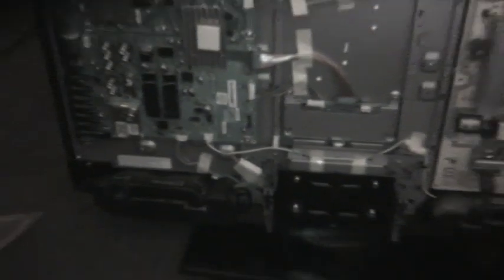This fault is reasonably common on these models and not many people have been able to figure out what it is. I think I've figured it out — there's a 3.3 volt supply on here, and this is including the Sharp service tip. That 3.3 volt supply is currently measuring about 2.4 volts, which is not very good. On the board you can see a switch mode converter with an inductor, diode, and a switcher IC.